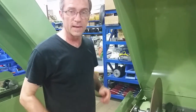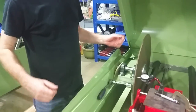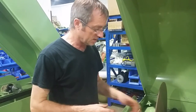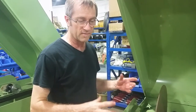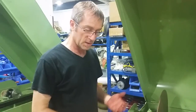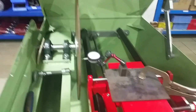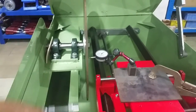Hopefully that will be helpful. If you don't have these adjusting screws, it's a little bit harder to get that perfect adjustment. But even so, if you use this method even for saws that don't have the adjusting screws, you can get them a whole lot closer and they're going to cut more smoothly and you're going to get nicer slabs and nicer cuts. If you don't have access to one of these dial indicators, we carry these at Highland Park Lapidary — you can just get them off the website.